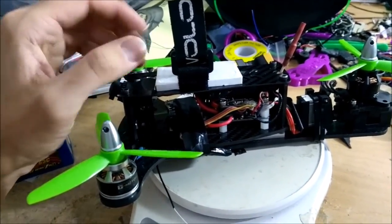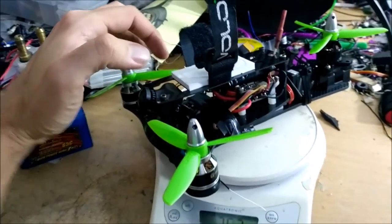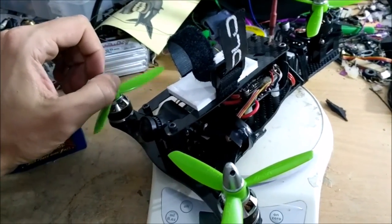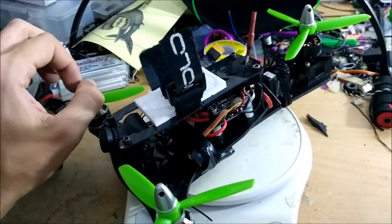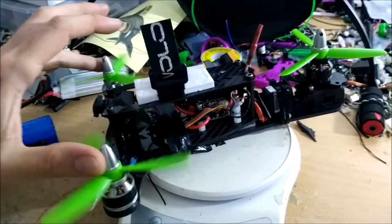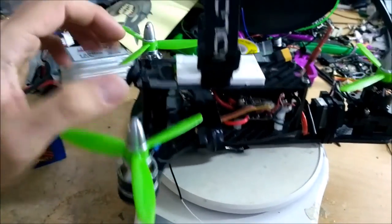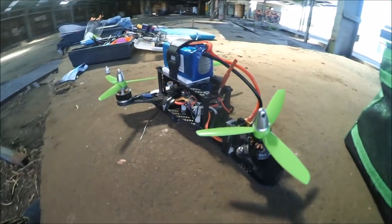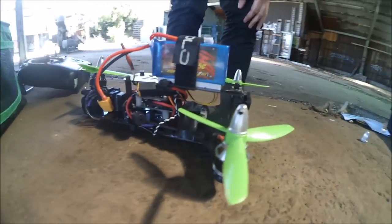As far as tuning goes, it's currently on Clean Flight and during today I was playing with the PIDs all day. I got it to a point where it was almost flying really almost perfectly, but then I kept fiddling and made it worse. Now I'm getting oscillations — pitch is where the oscillations are coming from, it's kind of hard to tell though. I need to keep fiddling with the PIDs, and I actually want to try Betaflight — I did read that Betaflight is better for tricopters than Tri-Flight. I don't know how Clean Flight falls in there, but Betaflight is the next step and I'll see if I can get it tuned really well. Now I'm going to show you a really short bit of DVR footage just to show you where I'm at with the tuning and flyability.